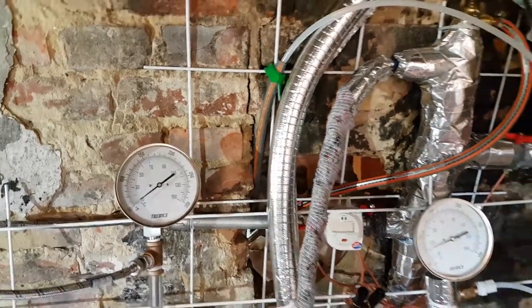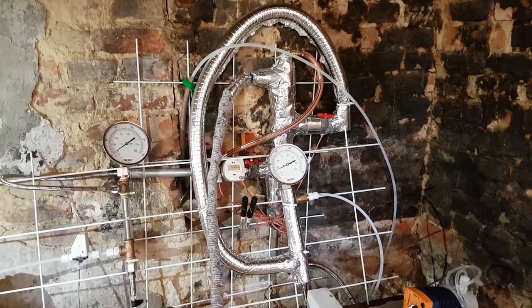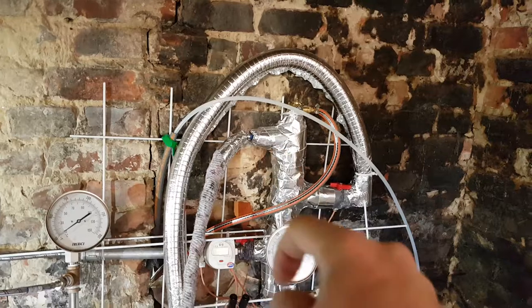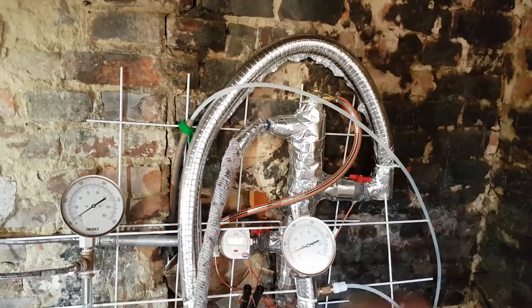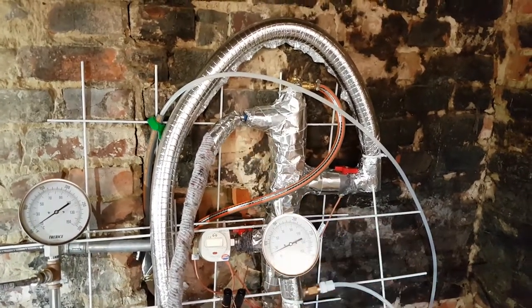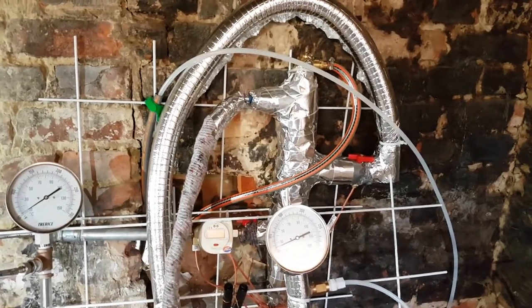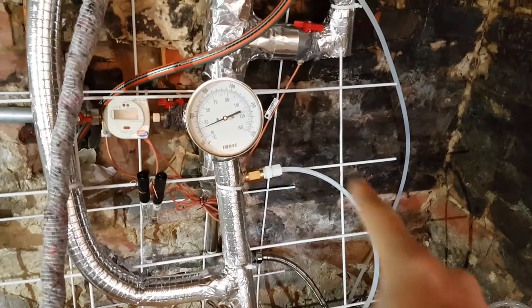What we've discovered today is if you don't have a lot of temperature coming into the hot side of the core columns of tubes that go through your hot part of your heat exchanger — if there's not a lot of temperature there compared to the input water, which there isn't — you really don't get a lot of energy captured, and it all comes out of the waste pipe down there.